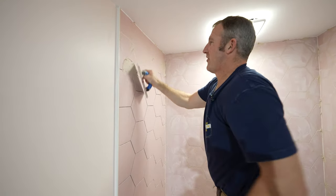The way you look at this is you want to be able to touch it and not pull grout off your fingers. I'm still able to pull grout off here, so I'll wait another 5 or 10 minutes and test an area. You want to be able to mold it with your finger and not pull any grout out — if it's still pulling out, it needs to skin over a little bit more. Use a damp sponge — you don't want any water in it. Water is going to be the enemy to this type of grout, so make sure you're wringing it out well.